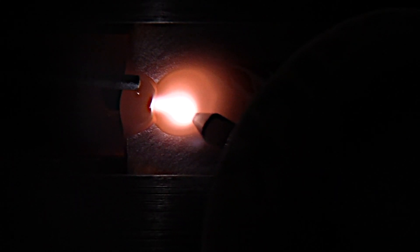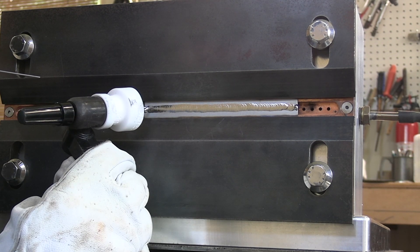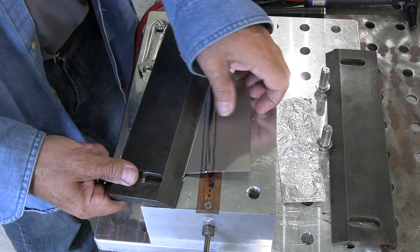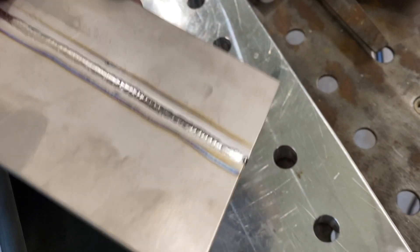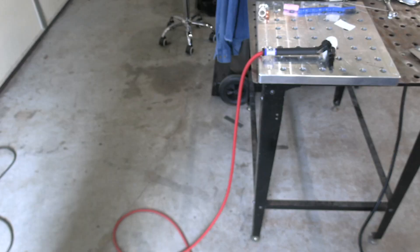That little extra dab on that tack is giving me freedom here to melt into it without blowing the end away as I taper off slowly on the amperage. Again, I'm holding my cup still while that post flow argon times out. I got a pretty good silver weld — there's some discoloration right where the chill bars meet, but most codes allow for it if it's that far away from the toe of the weld. Plenty of room for improvement, but I'm going to call it good and move on.